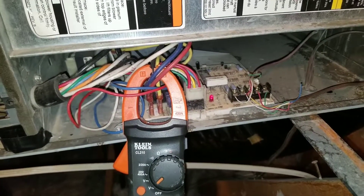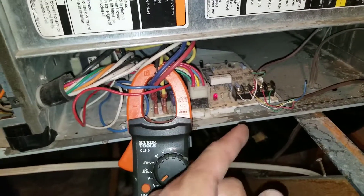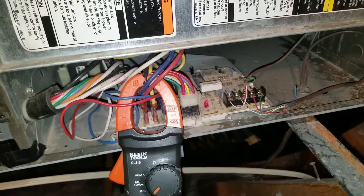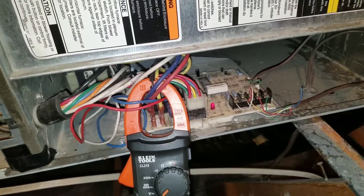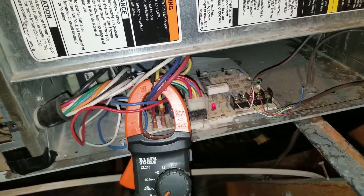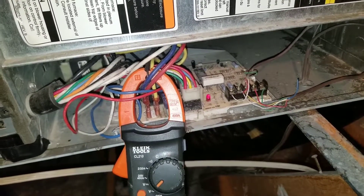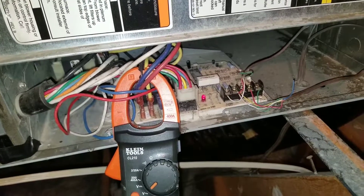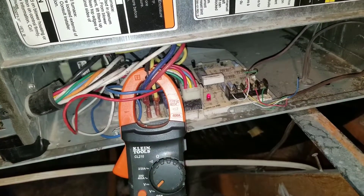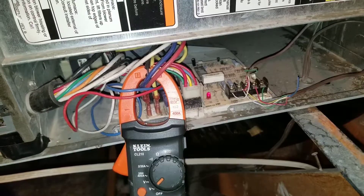The reason it's important that you understand this process is because if you do have a faulty thermostat, you'll be able to diagnose it because one of your terminals won't be getting the proper reading. So let's say you go downstairs, check your voltage on your thermostat — everything's fine, you turn the system on, and for some reason your AC doesn't want to turn on. You would come up here and check the voltage. If you have the proper voltage, then you know your thermostat is faulty or some other wiring issue. This is very helpful combined with the video on thermostat wiring, troubleshooting, and testing using your multimeter.